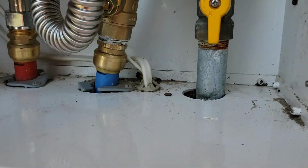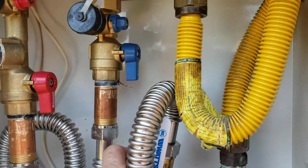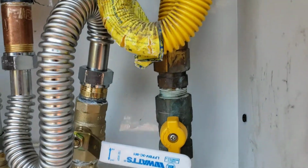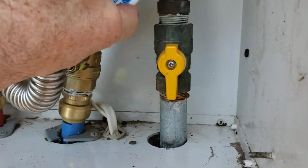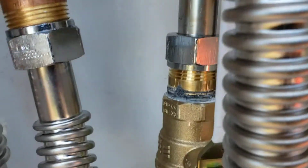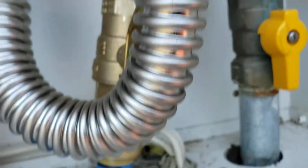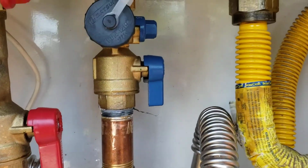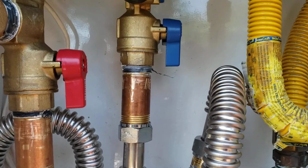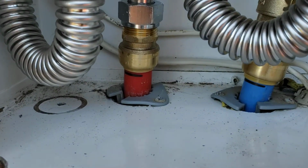These will spin, and so you don't need to use this valve at all, this cold water shutoff valve, unless something happens up here and it's flooding or whatever, you can shut it off right here. So it's just a 1/4 turn valve, and it just shuts off just like that, and then the water's off to the unit, and then of course comes back on. And like I say, this will spin a little bit. Falcon stainless steel connectors, and then of course brass nipples in between. So solid brass valve, brass nipple, stainless steel connector that kind of loops around and back into your brand new flush kit. So this comes with the unit. It's Rinnai, made by Matsui, and we're going to send you a video that shows you how to flush this. And so that's installed on the cold side. Hot side's installed, same thing, kind of loops around just down to adapter, no valve required.